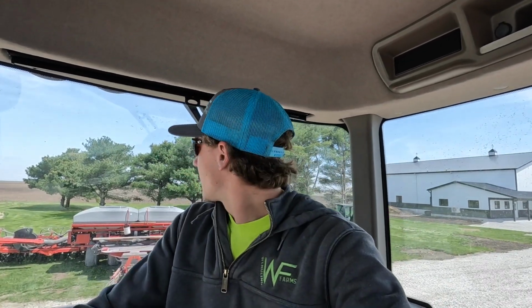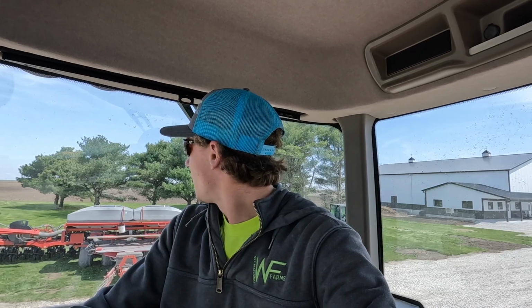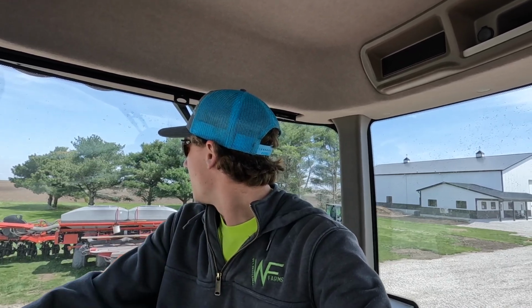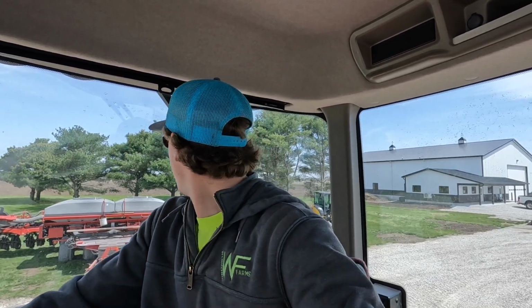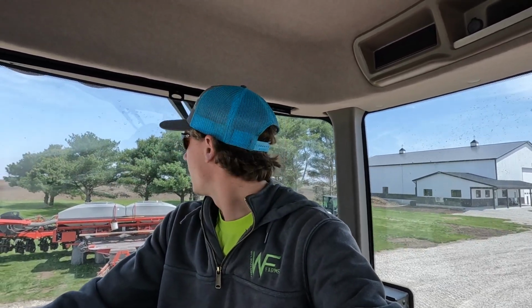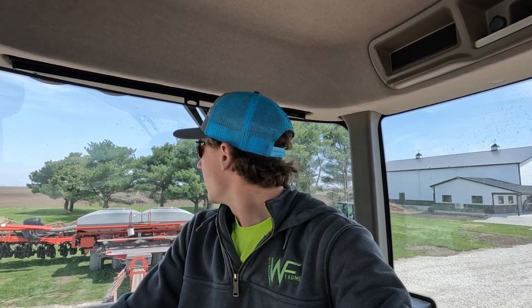So I've got all the units clean, and I left off the bulk hoses on the units. So I'm gonna fire up my bulk fill system right now. I'm just gonna fire up everything, the vacs, the bulk, just let it run. It'll blow them lines clean if there's any beans in them. And then I'll just prime the planter a few times just to run it all empty, and then I can start putting some non-GMO soybeans in them.